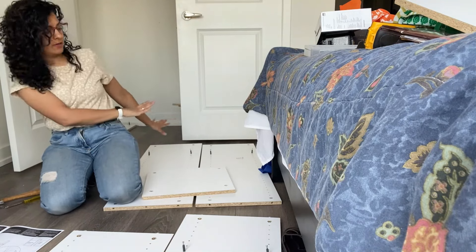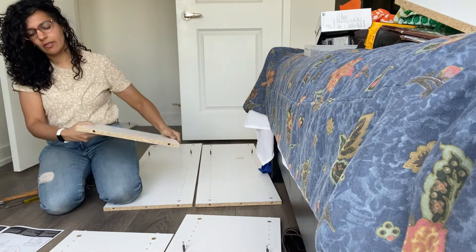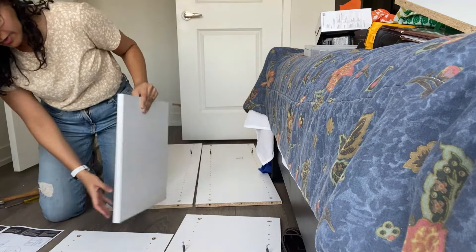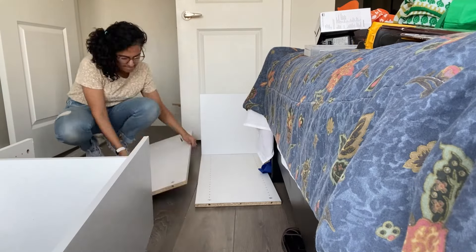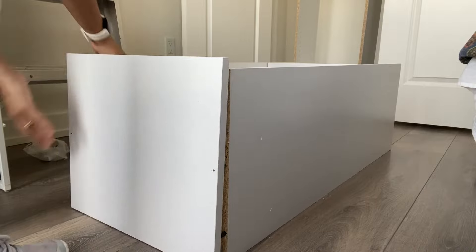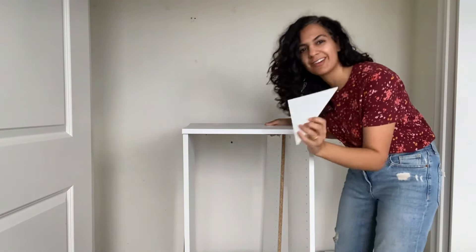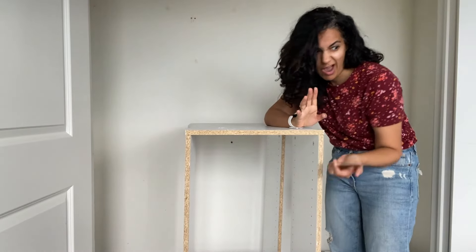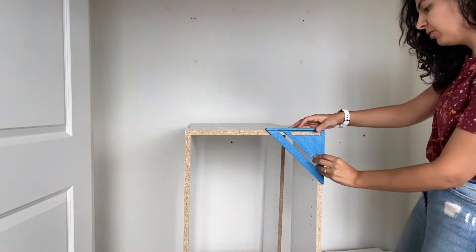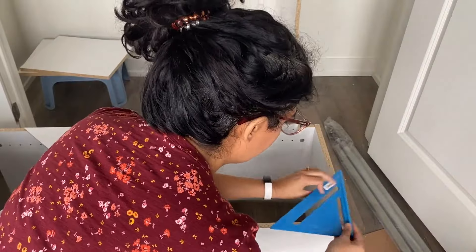Basically there's a bottom half unit and a top half unit, joined together by a shelf with these divots. Pay attention to the unfinished edges, where there are bigger holes and bigger gaps — those types of things. Make sure all the front nice edges are going to line up to each other. The bottom unit is complete. Now before we can actually mount this, we need to stabilize it — they come with these little triangles. Use a speed square to make sure it's square, then nail the triangle in place so the whole fixture will be square.